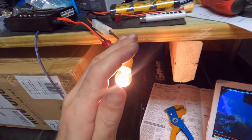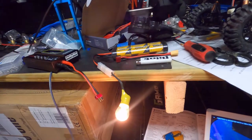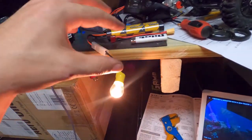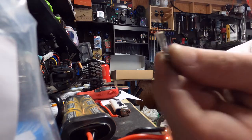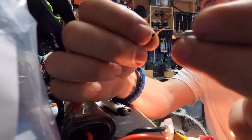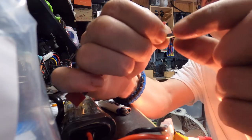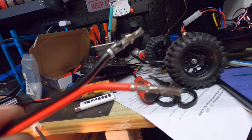That bulb is really, really hot — that's what I was talking about. This LED doesn't get hot at all; the incandescent gets extremely hot. If I put six of them together, that's why I used to have to put it on a wood block — it would melt or burn anything. To make the connectors: take the wire, twist it first, then take your connector and slide it all the way up inside, then take some pliers and bend those little tabs down and you're good.